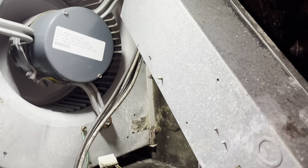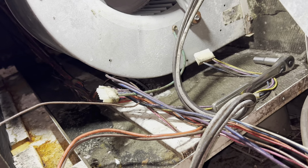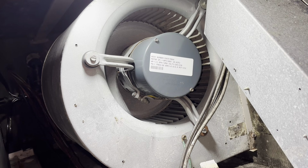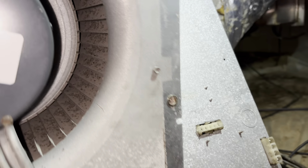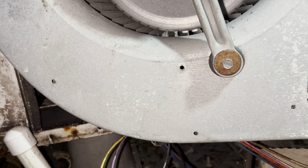Got everything unhooked off of it — I'll probably have to pull that out of the way. I'm going to get my blower unbolted now. I've got three, maybe four bolts, and I think it'll kind of come out. I think the bolts are on that side and there are pins on the other side, and that whole thing should pull right out. I was able to get this box out of the way far enough to ease the motor out. It'll come right off like that — get that out of the way, keep working the motor out of here, and set it down so we can work on it.